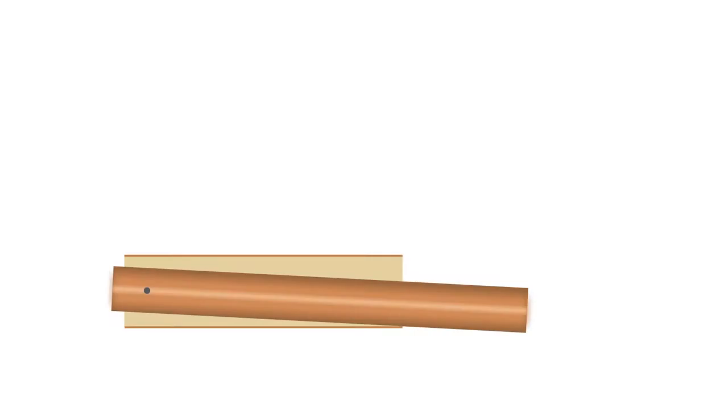Okay, the next step is building a double velocity sensitive sensor. The project is quite simple. I'm gonna use two copper plates separated with a piece of wood and a copper wire as a switch. I'm gonna connect the copper plates to Teensy's pinouts and the copper wire to the ground. In resting position, the wire is gonna be connected to the lower plate.